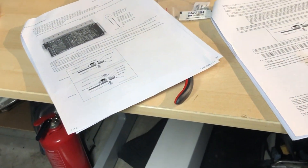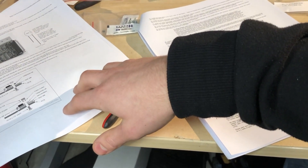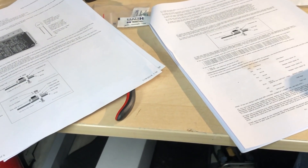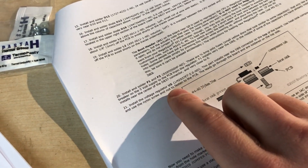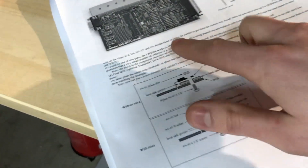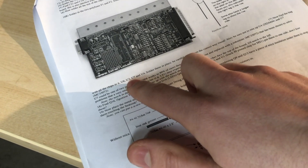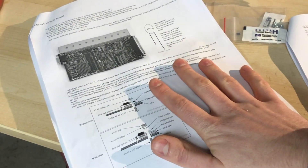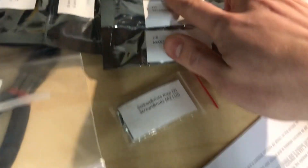But there are some mismatches — some parts shouldn't be mounted on the MS2, and some parts shouldn't be mounted on the MS1, and vice versa. I'm now at step 21, which says I should install the voltage regulator U5. The problem is that in the MS1 manual, the only voltage regulators mentioned are U6, U3, U7, and U4. They don't mention U5, and I've looked through the entire manual and I'm pretty sure they never mention U5.